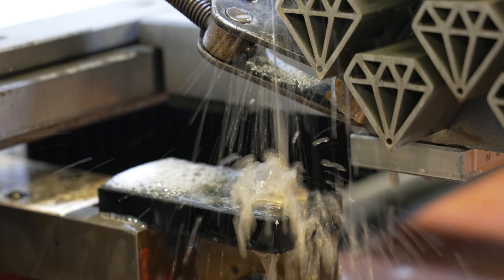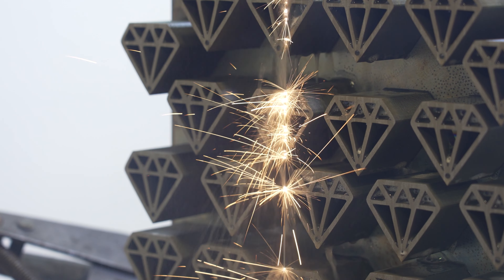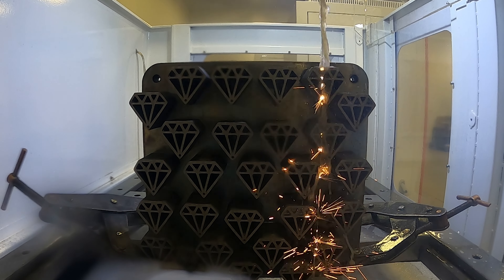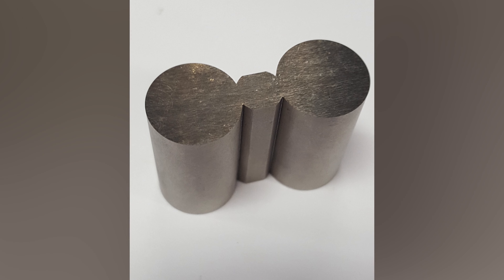These fast wire EDMs are not just for the 3D additive market, but for any EDM application with difficult flushing conditions, interrupted cuts, very tall cuts up to 1.2 meters, dissimilar metals, and more. They are full 4-axis wire EDMs that can cut punches, dies, molds, fixtures, and tools.